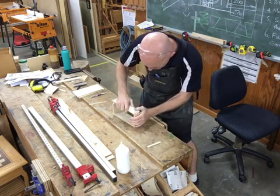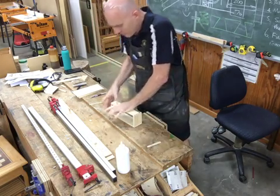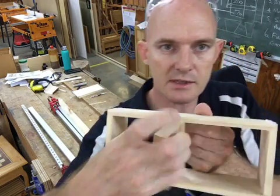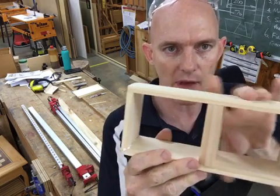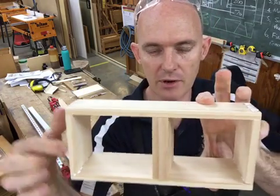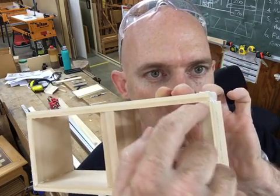And the front top. So with these things in place, now if you've got a long box like mine, you may need to have a spacer stick inside here. So what I've done, because a long box, once we put clamping pressure on this, that's going to potentially bow that box a long way inwards. So we're going to put clamp pressure on this end and on that end, and also going in from the sides as well. So a little clamp block needs to be the same length as the shoulder.